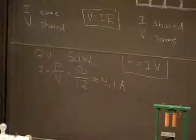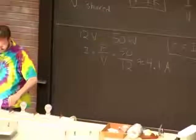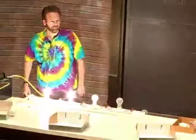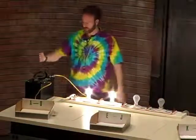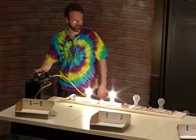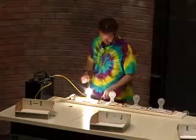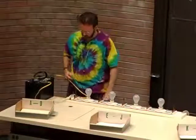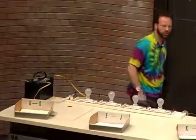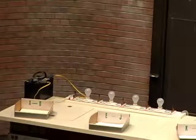And that's what would be flowing through that bulb. So we got 4 amps here and 4 amps here. I know this must be drawing 8 amps because they're in parallel. There you go. Series and parallel circuits. Any other questions at this point? I'm sure as it sinks in more, you might have more, but...